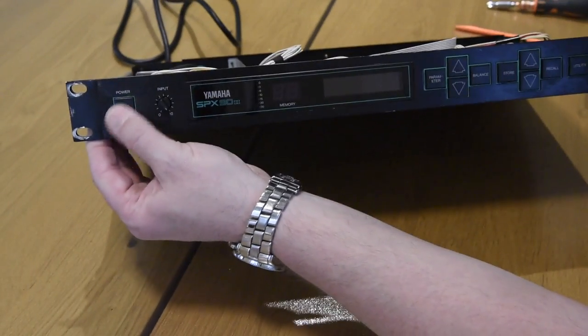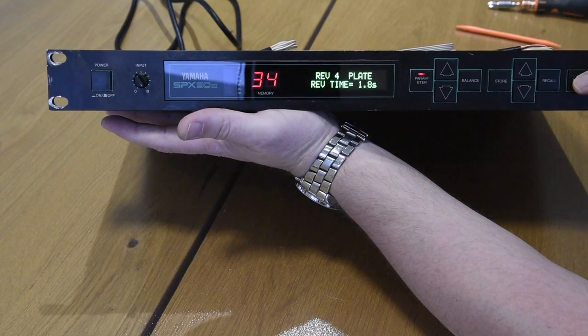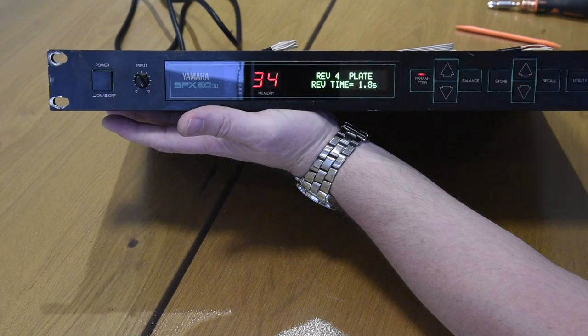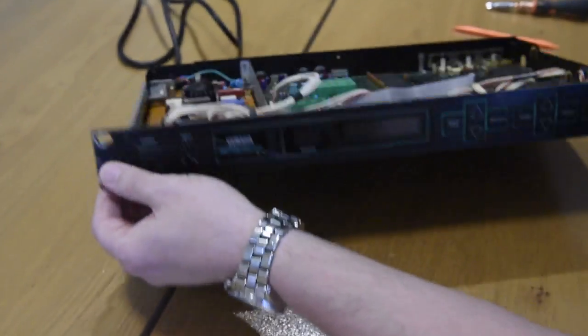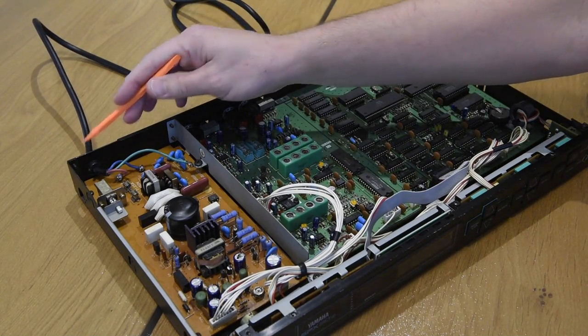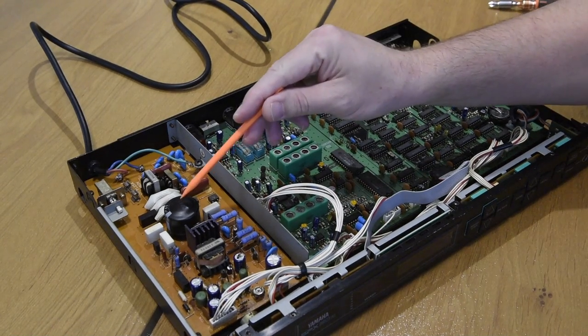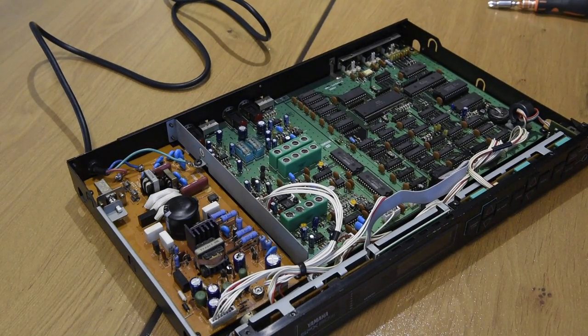So you'll be able to see there a nice bright OLED screen, and all the buttons now work as they should. In this first video we've gone through replacing the battery and battery mount, replacing the mains cable, details around the capacitors and some of the circuitry, replacing the screen, and repairing the dirty buttons on the front of the unit, plus a bit of detail about the input pot — if it's dirty and what symptoms you'll see. The next video will go through replacing all the capacitors. It will be interesting to measure the capacitance of some of these, especially the blown one, to see how degraded they've been over the last 30 years in a unit that runs hot.